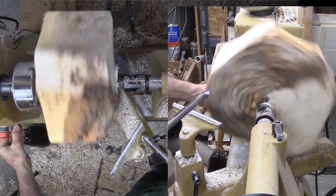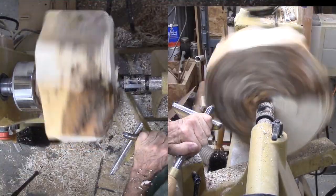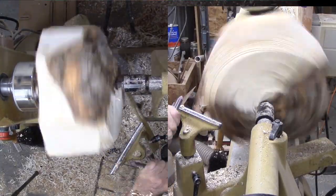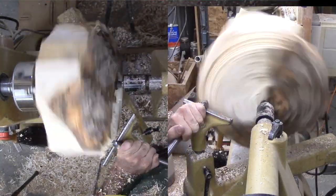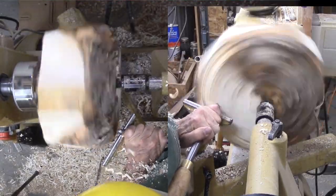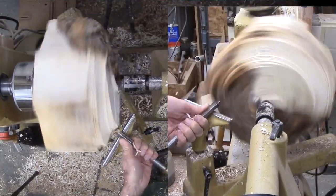It is big and heavy and difficult to mount to the lathe. I have nipped off the corners but deliberately trying not to cut a circle because I want to keep the ability to adjust the wood. Too tight of corner cuts would hamper my ability to find a great position. I cut only enough to mount the wood. The wood surface is flat enough to be pressed against a closed chuck with live center pressure.